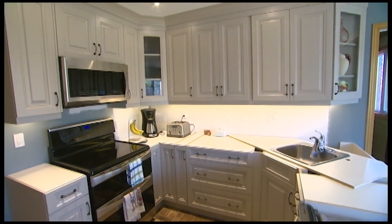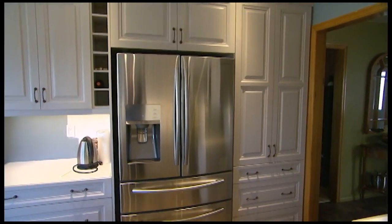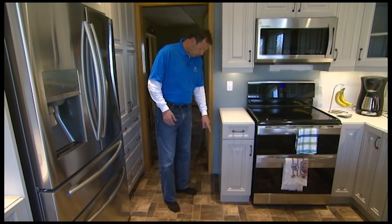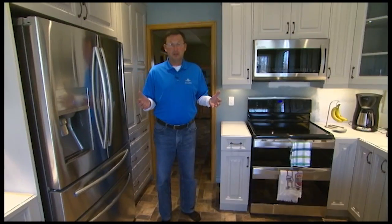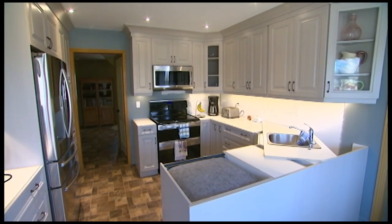For this reno, we left basically the flooring. We wanted to keep the same template as the original kitchen, so we had to keep the same template as much as we could. One issue we had is there's a little area where the flooring came out a little further than our cabinet did — we repaired that, and there's one near the fridge as well, just a little three-inch patch. The customer had flooring and was able to find it for us. When you're doing a reno with flooring or tile, always keep a box of tile or a little bit of vinyl, because if you get a mark or a nick, you can always replace it with something you have.